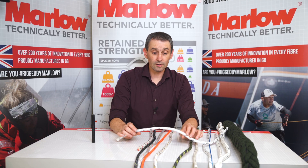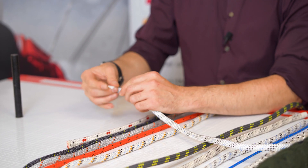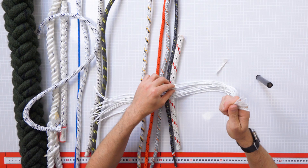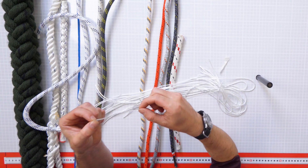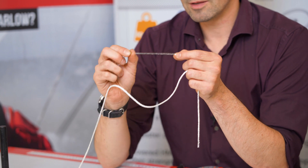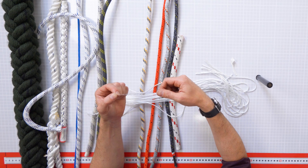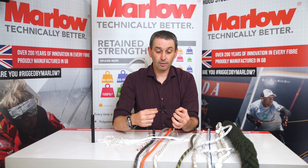In addition to just simple coloured markers, some ropes like this static rope have a whole centre tape inside, giving a whole load of additional information. Inside this rope there's a centre tape that denotes when it was made, the company that made it, the standard that it meets, and the material it's made from. That should be present in all of the static ropes. This tape is actually a requirement of EN 1891, so you'll find it in all of the static ropes, all of the arborist ropes, and all of the PPE ropes essentially.